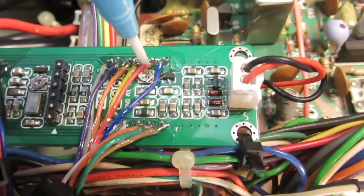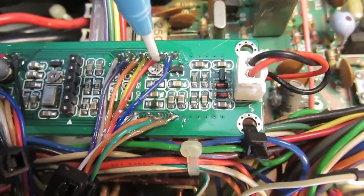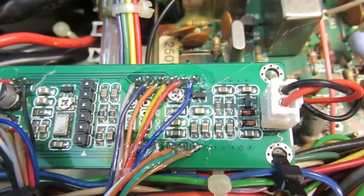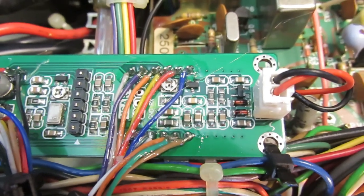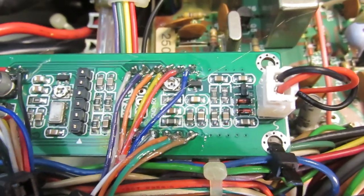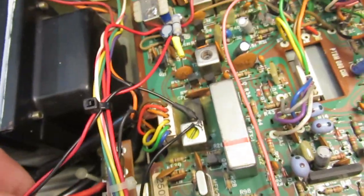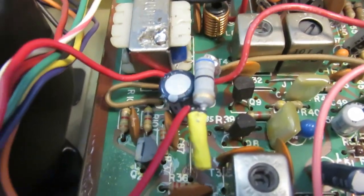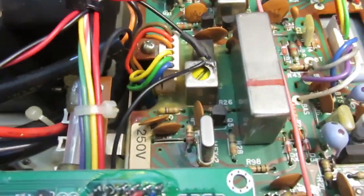And this one here, you can see I got it split right here. This is for the sensitivity, to get max sensitivity out of the counter. And I had to play with that to get the counter to read this test point correctly. So this one was totally different. I actually took the 12 volts and padded it with a 175 ohm resistor and knocked down the voltage with a simple resistor. Tied everything to ground.